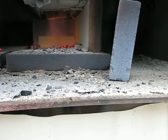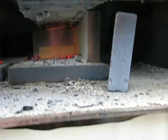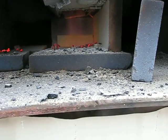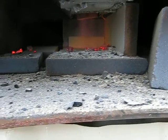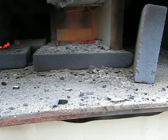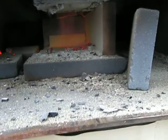It's been burning good for quite a while. The water temperature's up to about 120. I have it set to 175, that's where it'll kick off. Got my in-floor heat pumping around, so it's doing good. Next time I'll put these fire bricks back up so it'll be more efficient. I just pulled those down — actually those two tipped over when I pulled this front off. I'm going to stick them back in there next time. Burning nice and hot — that fire brick is glowing orange, nice good burn.